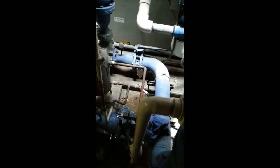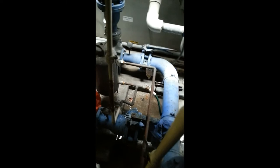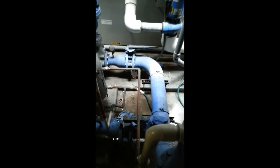I think we'll put a way to purge your air in here too — I don't see why not, it makes sense. Higher pressure goes in here; this is the pump suction so this is going to be a lower pressure. So if both these valves are open, the water is going to go through the tank so the chemical gets sucked and forced into the closed loop.